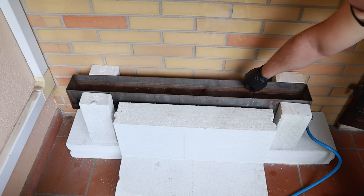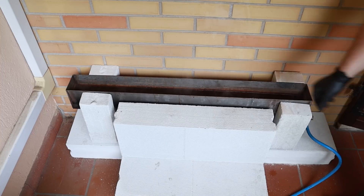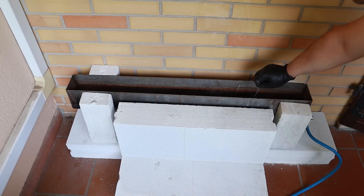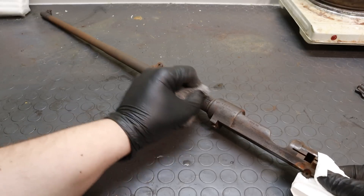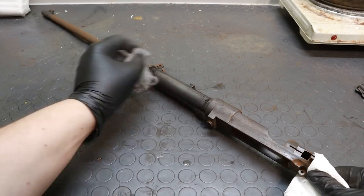All we have to do now is rinse the part and then dunk it in boiling water, keeping it to a rolling boil for about 15 minutes. Over this period, some of the rust will chemically react and turn black. After that, simply take the parts out and scrub them with fine steel wool. Most of the black oxide will easily wipe off, except for a very thin, tightly adherent layer on top of the surface, which is our newly formed bluing.